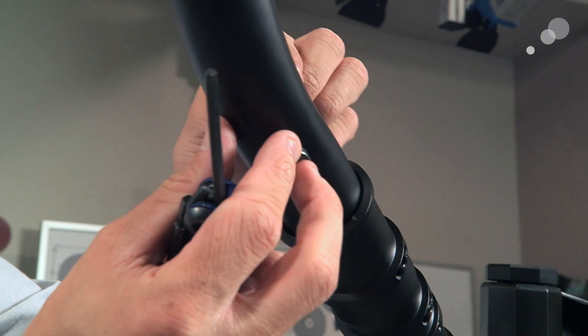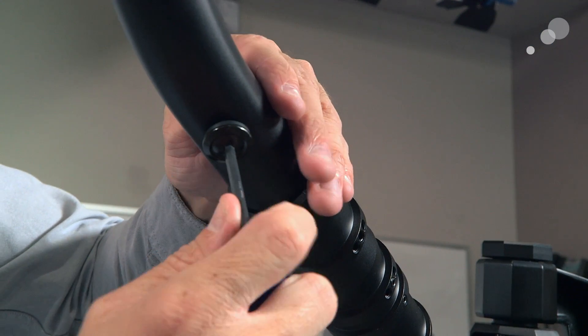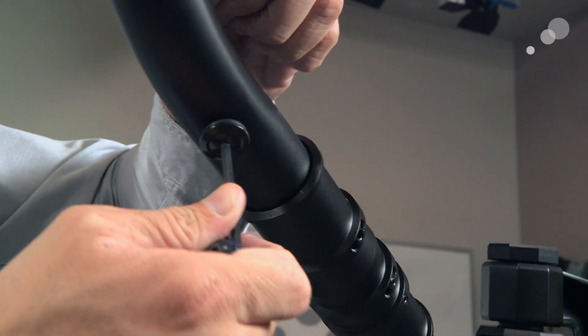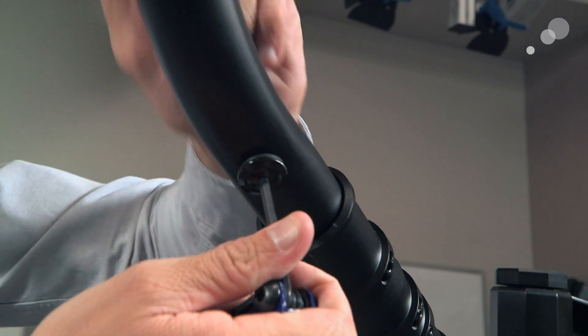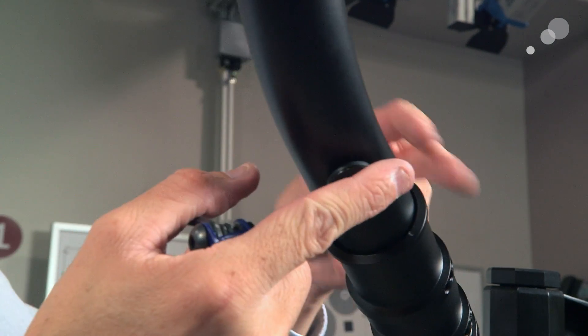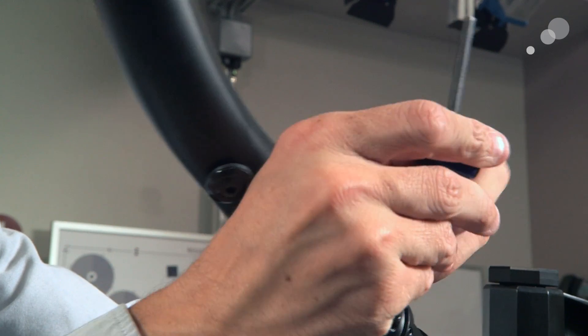What I'm going to do is take two four-millimeter Allen keys, just like so, and lock this into place — just make sure that it's tight and good and snug. I still feel tension; it's still locked into place and it's not going anywhere. Then I can also go back to the collar and take my Allen keys to lock down these little set screws as well.